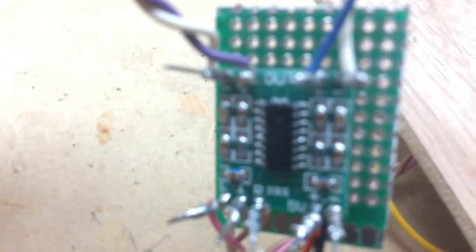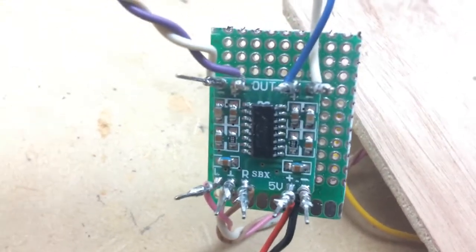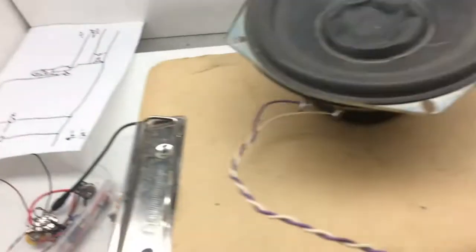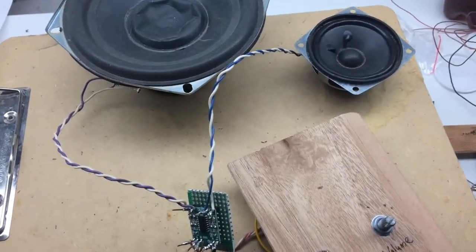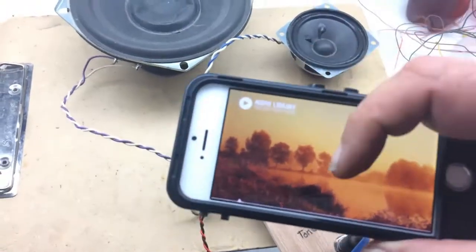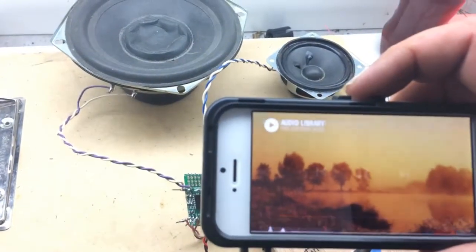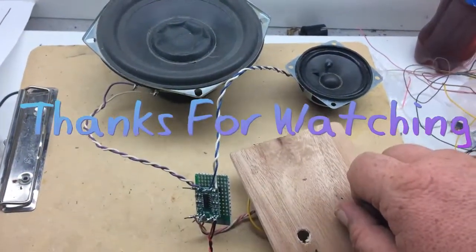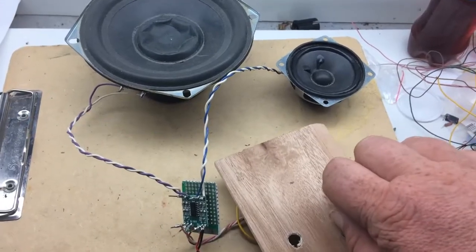That's it — that's our completed project. That's a 20-cent amplifier. I'm getting a little bit of feedback out of it because we're only running at 4.5 volts and it really likes a solid 5 volts, but I have this regulated 4.5 volt power supply so that's what we're using. Sounds great for a 20-cent amplifier chip. And there's our volume control.